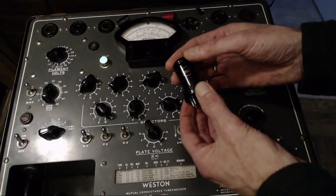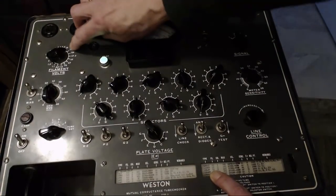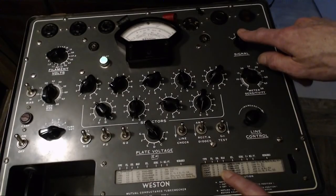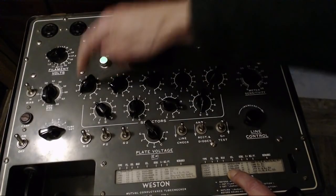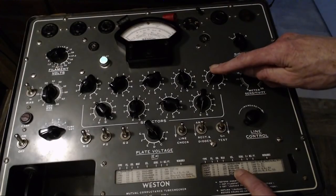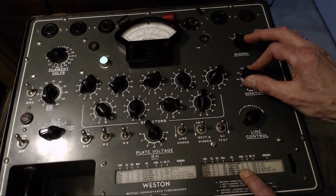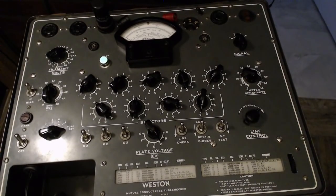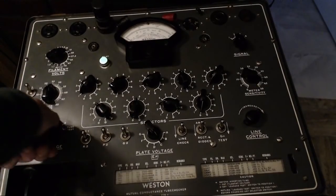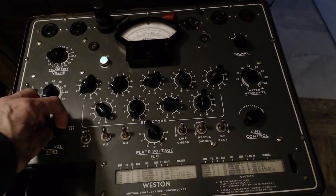Okay, so I'll set up for the next tube here. Okay, I think we're ready on this tube. 12SJ7. 12SJ7, 13. Filament voltage, signal level 2. Bias 25 low, 17251, 4630, 45, and we're good to go. I suppose any tube with a short between the heater and a tube element could produce that kind of hum we were hearing.